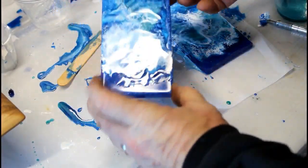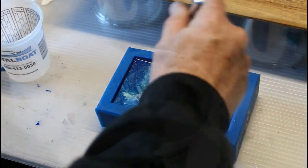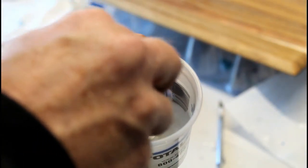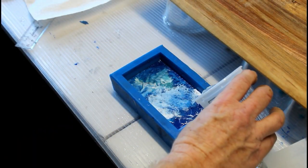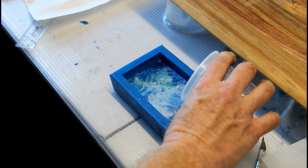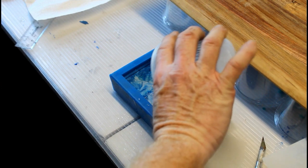The plan is to finish the wave exactly the way I want it and then cast clear resin over it. The bottom casting of solid blue is done with TotalBoat's Thick Set Epoxy. The waves are done with their Maker Poxy, which is a little bit thicker and better for making the waves. Then I put that combination back into my mold and poured TotalBoat Thick Set — which, even though it says thick set, the mix is actually thinner. It's a very thin resin that allows air bubbles to easily float to the surface. It has a very long set time — almost 24 hours before I can remove it from the mold, and five to seven days for full hardness. So I poured clear resin over my ocean waves and set this aside for 24 hours.